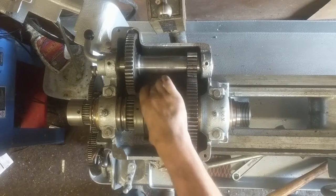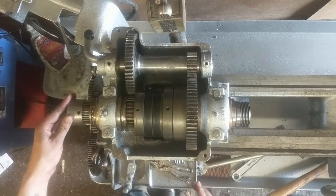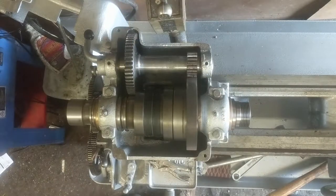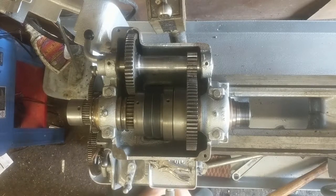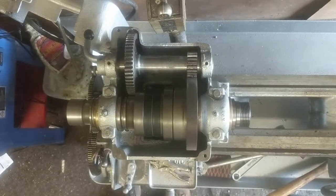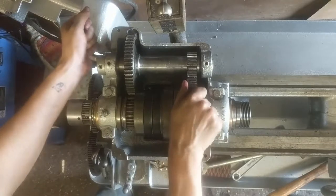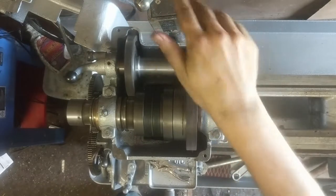So that's got it. The adjuster has run almost all the way down and there's still some play in these belts, so you probably want to go with a 5L 540. Reverse works, and forward works of course. And if I reach down and change the belt to a different step on the pulley, we get a faster forward speed. And if I disengage the bull gear and put the back gear in, we get low speed. We just put the grease on there so it still flings some of that around.